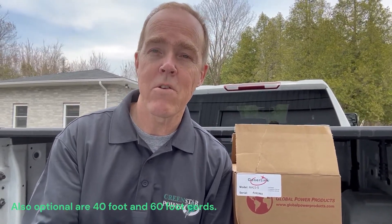There are a couple of options to consider when purchasing your Generalink. If you have a higher-power generator, you'd probably want to go with a 40-amp so you'll have extra power in your house. The Generalink also comes with surge protection or without. With surge protection, it provides protection if your generator suddenly puts out a little more power — sudden surges — and makes sure those surges don't reach sensitive appliances. So you have two output options — 30 and 40 amp — each available in surge or non-surge, plus the plug option on your power cord: 20, 30, or 50 amp. Green Star Power can go through all those options with you.